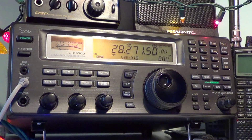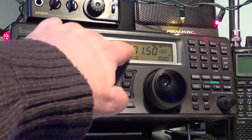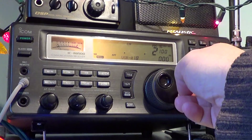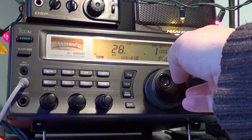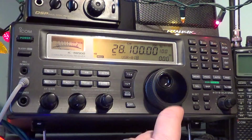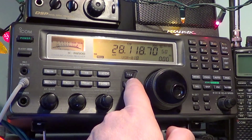You have to be in single sideband. If you have a portable receiver, just put yourself in single sideband to hear the tones of the Morse code signals. If you have upper or lower sideband, it doesn't matter much — upper sideband works fine. If you have an SDR radio like I do, I put it in CW mode since it's Morse code. Typically, beacons start at just around 28100 and go up to 28300, so you just tune slowly.